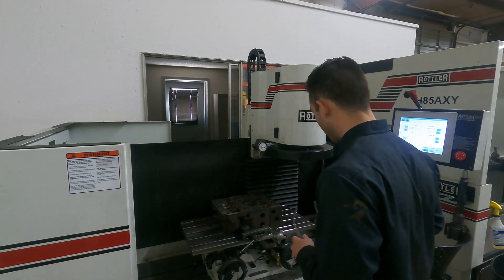One way to work around that — another option available with this machine — is that even using the same dual axis leveling table, we've gone ahead and trammed the surface. I put a dial indicator under here on the cutter head and we sweep back and forth across this table, left to right, then zero based on what the dial indicator says. That gives us a nice square surface to our machine spindle, so we should be cutting parallel.